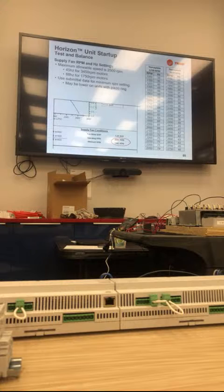So you guys don't make a high static setup? We do have high static, but we typically don't do high static with a 3400 RPM, 3450 RPM motor. Those will typically be the 1800, but we use a 25-inch wheel, or dual 25-inch. I walked up on something that was damn near 100 before. Yeah, those we're over speeding those fans like crazy.